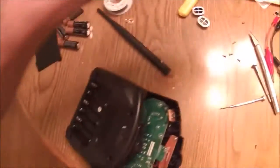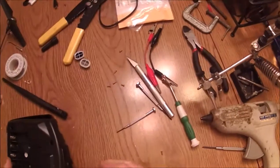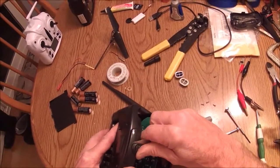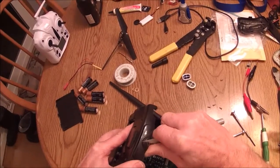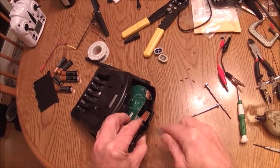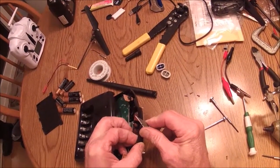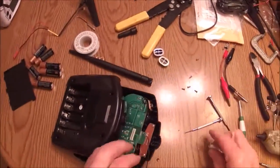Okay, we're back. I just took a Dremel tool and cut that off there, so I've got that done. I'm just going to take my X-Acto knife and get the flash off of it that was caused when I cut that off. I left a little bit of a lip sticking up so that the nut will have something to set on. Let's clean this out right here and trim a little bit off. Looks pretty good.